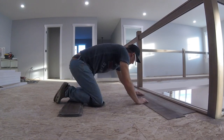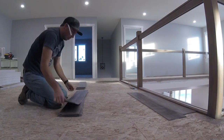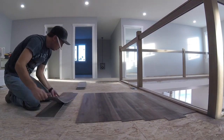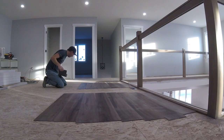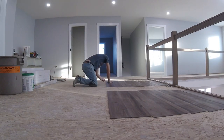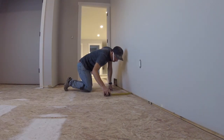To make sure your flooring runs square with the house, you want to snap a line across the longest part — in this case, through the bedrooms. Because the railing is the main focal point in the room, we're going to want a full piece of flooring up against it. That's why I'm laying out planks until we line up with the bedrooms. Snap a line across the marks you made, then check the chalk line to make sure it's straight with the bedroom walls.